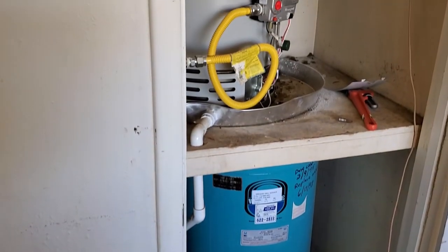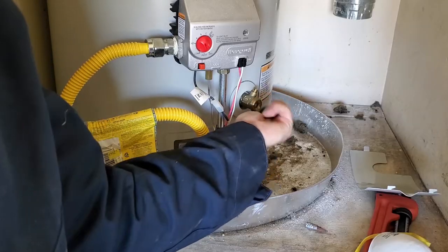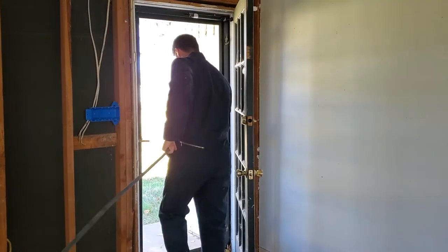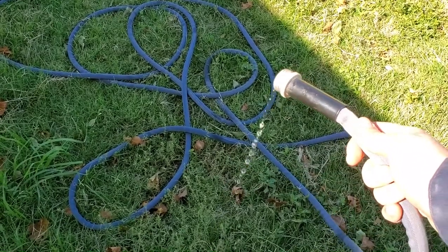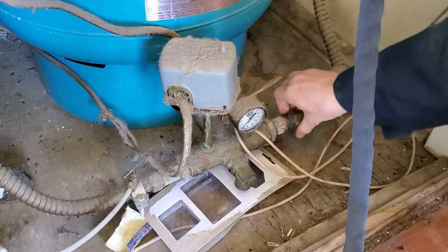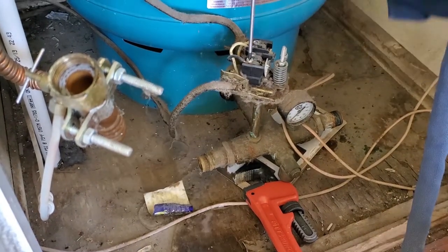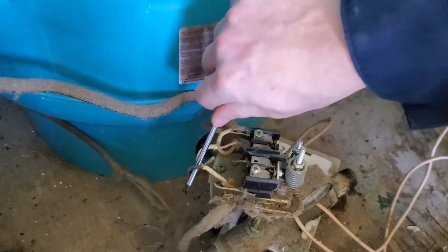For at least the last 20 years, both the pressure tank and the hot water heater have sat in this closet. The weight of the water combined with the point load of the beam between the kitchen and the dining room is ultimately what caused the floor to be deflected downwards. I'm going to be moving the pressure tank to a different location and replacing the standard gas water heater with a tankless unit. By making this upgrade we'll not only reduce the weight on this point in the house but also gain an extra closet, which is valuable space in a house this size.